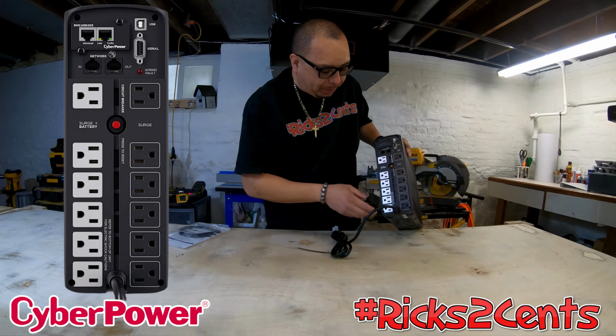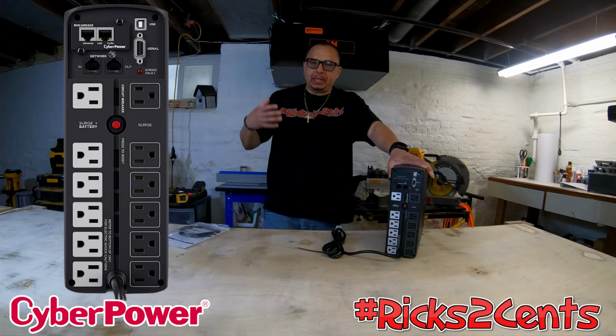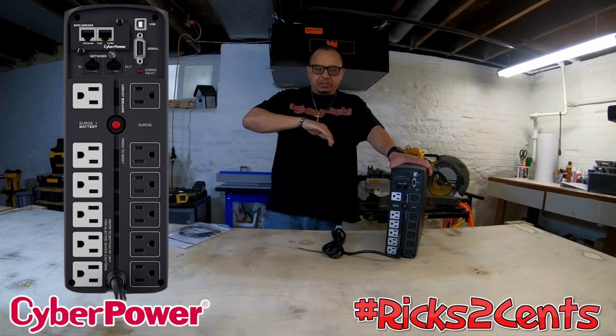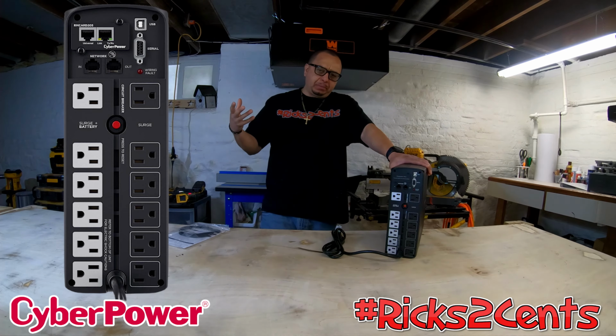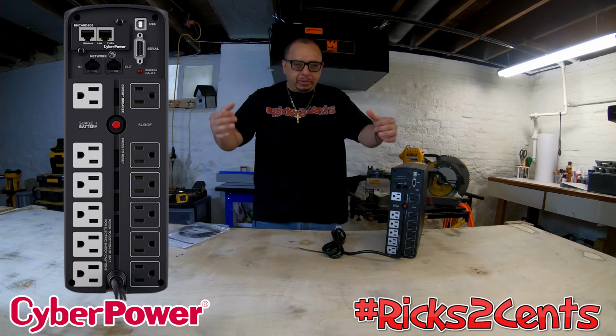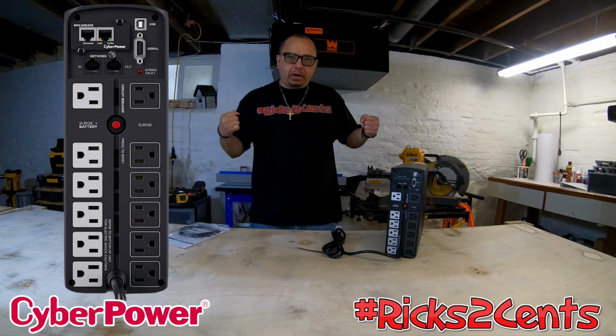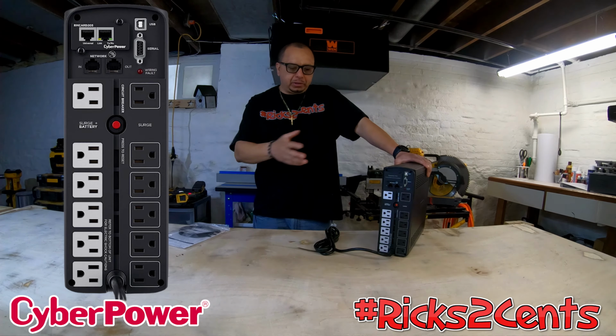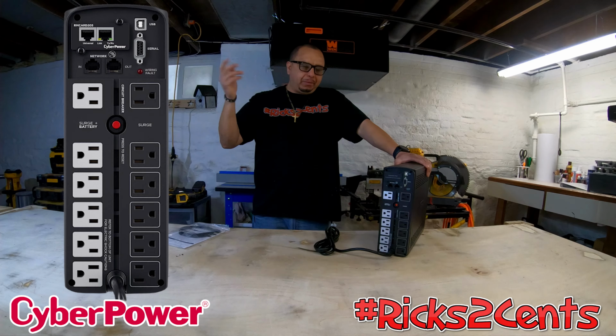So if it's on battery backup, when you have a piece of equipment that has a large amp draw, like when it first turns on, and then once it's actually running, which is how most equipment is. When you first turn it on, it draws a lot of power, pulls hard amperage, and once it's running, it's really not pulling anything. Because of that, I always just plug it in the battery side. So if for some reason it pulls a lot, we'll never trip a breaker, so to speak. It just pulls from the battery temporarily, and then once it's up and running, it's fine.